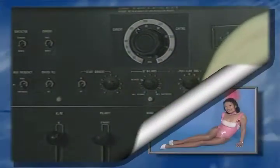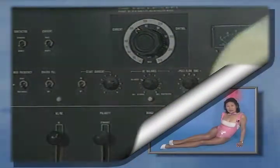For that thickness, we're probably going to be right at about 140 amps, but I'm going to bump it up a little bit so I can control it with the foot pedal again. You always want to set up a little hot. And we move the high frequency to continuous because we want that thing to be buzzing continuously. All right. I wonder what that's doing to our audio, by the way. Chuck, did you notice anything? Yeah. I bet the video isn't going to like the continuous high frequency.